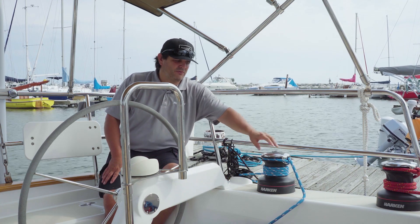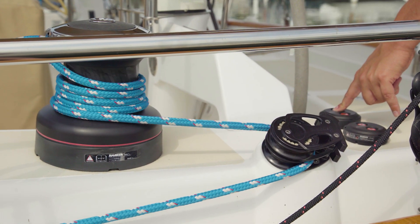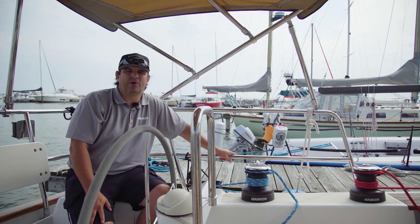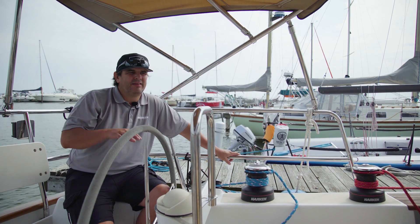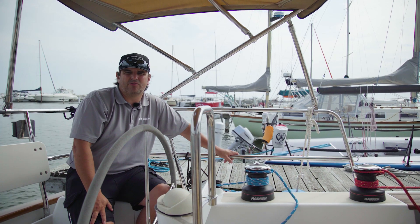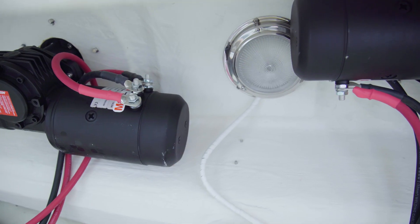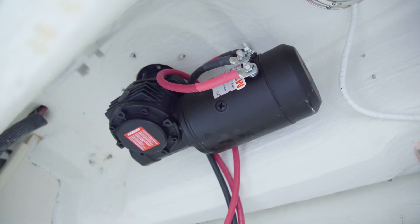Basically what's involved is removing the winch from the deck and drilling an access hole for the motor and gearbox to be bolted to the bottom of the winch. Pulling the cables can be a little tedious because you don't want to ruin the interior of your boat and you want to maintain the look. You also have to mount the circuit breaker and the control box, which can be mounted at different locations throughout the boat wherever it's convenient. You also have to make sure you have room for the winch below deck so it's not a hazard to someone's head or another system on the boat.